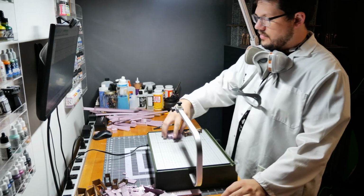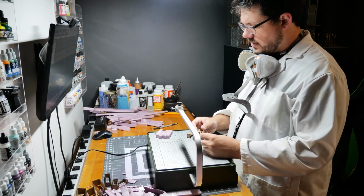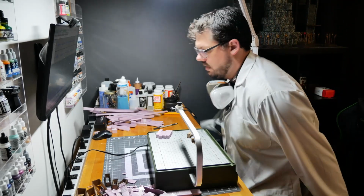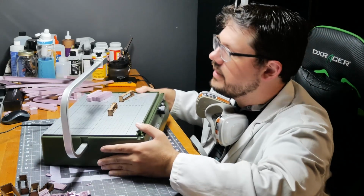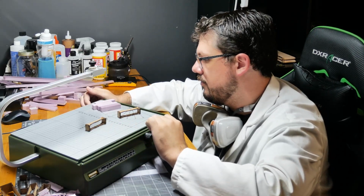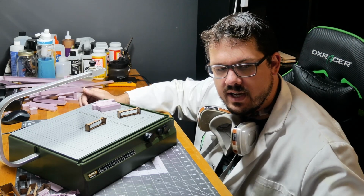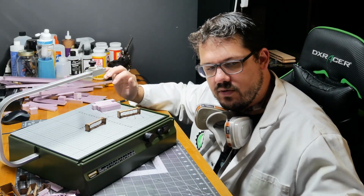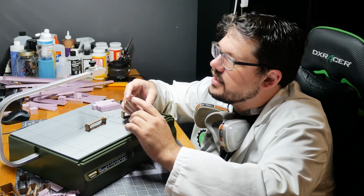Okay. We're down to the final 4. And I've learned quite a bit while doing this. The trick is, the small ones, I mean, just lower the setting on the pillar. Let me sit down so you can see me better. The trick is to lower the setting, the dial on the Proxxon, or I guess whatever hot wire cutter you have. Hopefully it has multiple settings. You want to lower it as much as possible when there is a lot of detail. Because early on I wasn't doing that, and some of the curves are so tiny that they would not end up looking like curves, or they'd get warped in the middle. And it still looks fine, especially from a distance, no one's going to really notice. But on these small guys, you can see how tiny these ridges are here. You really want it at the lowest setting possible when going over them.